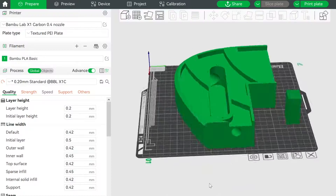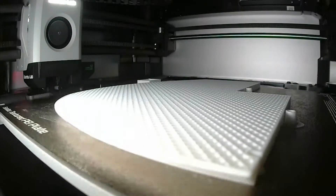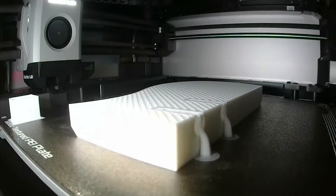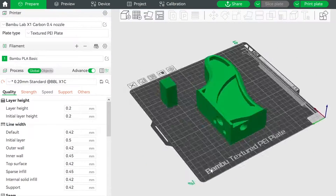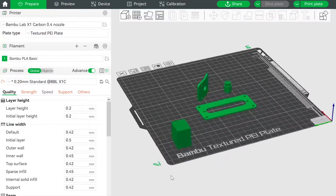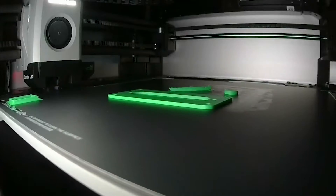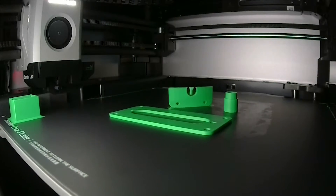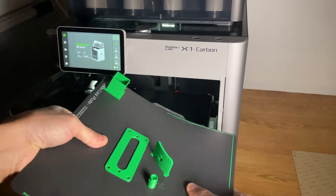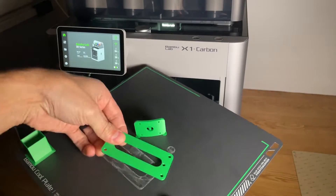Since the outer pieces do not see any significant load, I printed them using the standard profile with 25% infill and the default two perimeters, and I found that these values worked well and prevent the guitar body from flexing or warping. The smaller jack cover and pickup cover were both printed with 100% infill, and all parts were printed with 0.2 millimeter layer heights with tree supports used for any overhangs. I've included the 3mf files in the download which includes all the print settings automatically preloaded.